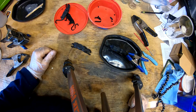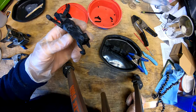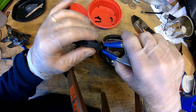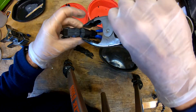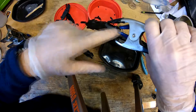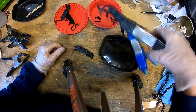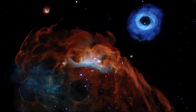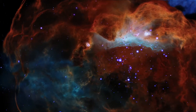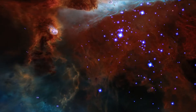This is Fila Cube PLA 2 black, very similar to the gray, so we're printing with the same parameters. In cold temperatures we're printing at 248°C with 30° bed temperature — this one could probably have done better at 35 or 40. If you're printing something that doesn't need this kind of profile you can print at a lower temperature, easier to get off. In warm temperatures we're printing at 230°C with 30° bed temperature. If you like this video please give it a thumbs up and post a comment if you have any questions. Subscribe to my channel and turn on the notification icon — this is Beta Signi signing out, and keep looking up.